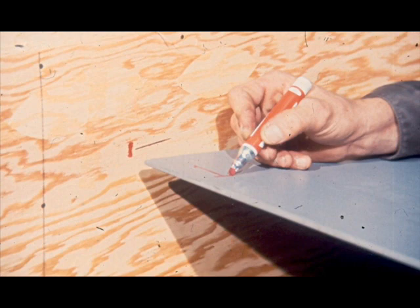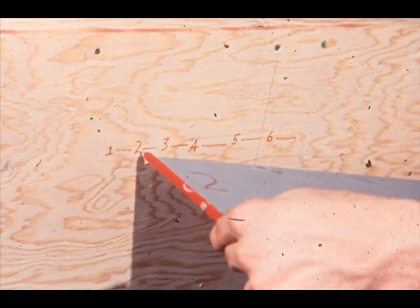Here's another tip that may prove to be of help. When marking the track of each blade on the shroud, as we just did, match mark each of the marks with the blade to which it corresponds. In other words, mark number one next to the first mark and on the blade that went with it. The next blade and its mark would be number two, etc. This could save confusion in trying to locate a problem blade.